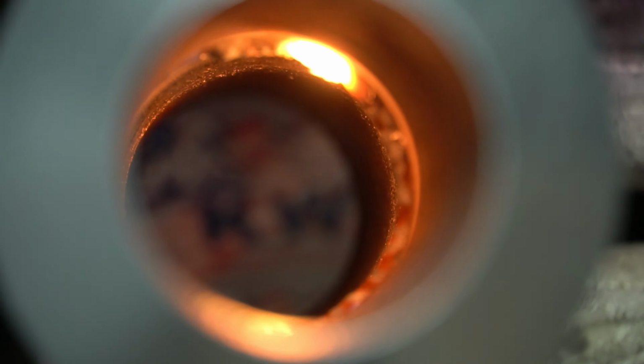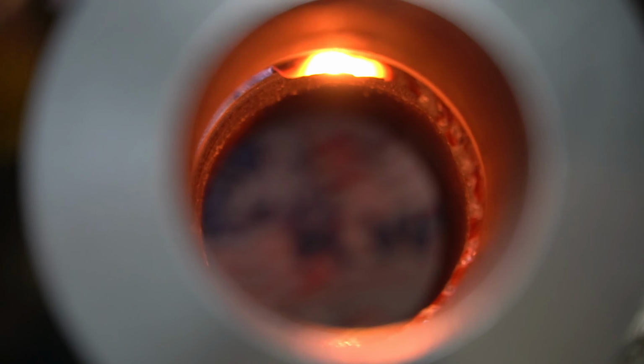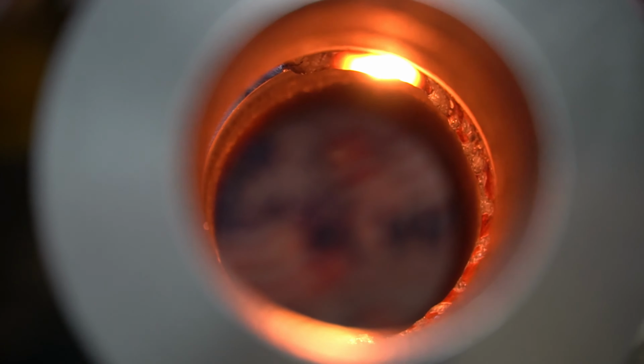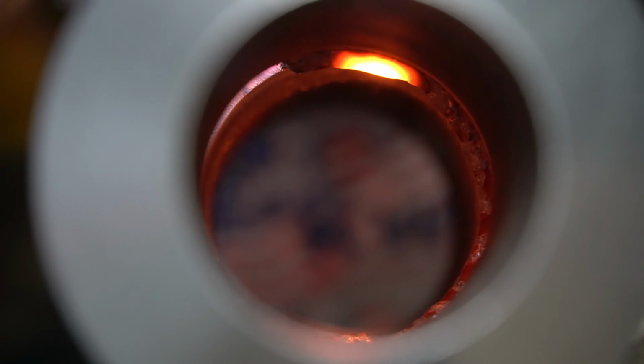And you're just adding the same amount of wire all the way through to the tack. Another thing is making sure that you're tying into your tack completely. The way I do that is I get to my tack and I'll tie in, and I'll hang out up top for a while, and I'll add wire as needed. As you can see right here, just letting it all tie in nice and efficiently.